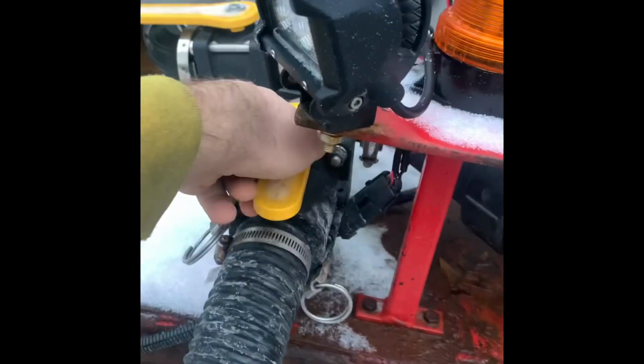So we got our hose down here, fill hose. I'm gonna take that, make a connection right here. Now that that's connected, I'm going to open up the valve here. That's allowing water to come down the hose all the way up to here. And open this valve here. That allows water to come in through the pump. And then it's going to pump up through there. So I'm going to go ahead and start this up. Start it pumping.